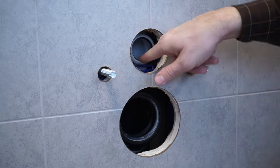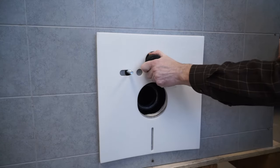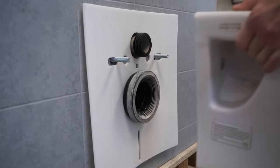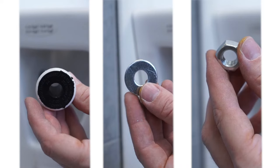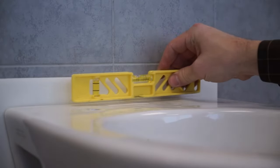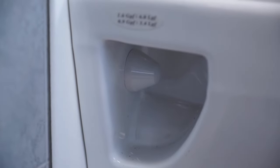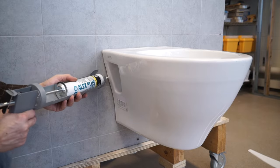Lubricate the flush and waste openings in the wall. Place the sound insulation pad in position over the bowl. Insert the flush pipe, turning while pushing until it stops. Then insert the waste pipe the same way. Lubricate the ribbed flange of the flush pipe. Carefully position the bowl so the supply and waste flanges are firmly seated and the mounting rods protrude through the openings. Secure the bowl with the rod sleeve, washer, and nut. Hand tighten, confirm the bowl is level, then tighten the nuts on both sides — be careful not to overtighten. Snap bolt caps in place, trim the sound insulation pad around the contour of the bowl with a utility knife, and add a bead of caulk between the bowl and wall.